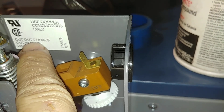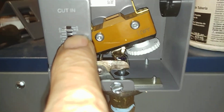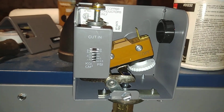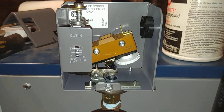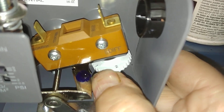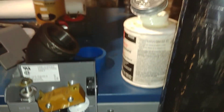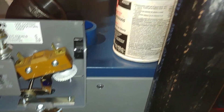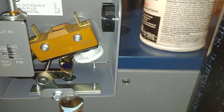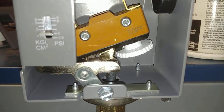There's a sign that says cut-out equals cut-in plus differential. This is the cut-in, and it's set at — here we are in Baltimore, Maryland — so I guess they assumed we were going to steam crabs with this boiler. But no, we're just going to heat the building. We want to set this at its lowest possible setting. There's a differential wheel set at one. You want to take a slotted-head screwdriver and turn this screw counterclockwise to bottom it out as low as possible.